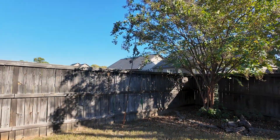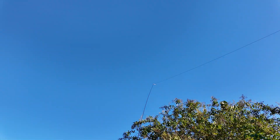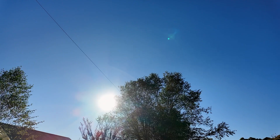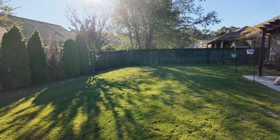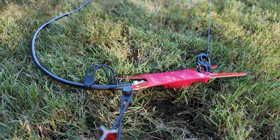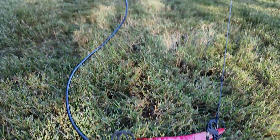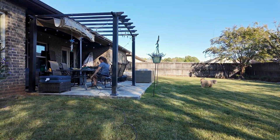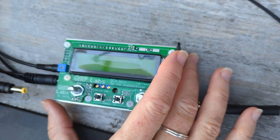We have a POTA 20-meter mast, and it's right up there, slanting down across our backyard. POTA dog Roscoe is helping put up the antenna. This is the end-fed half-wave, cut for 40 meters. Ready for some power and hooked up to a real live antenna.